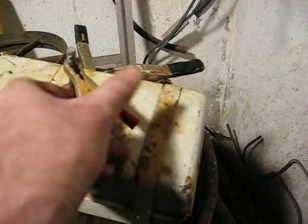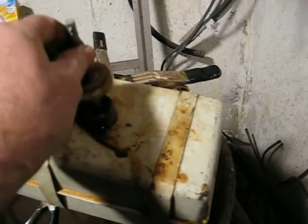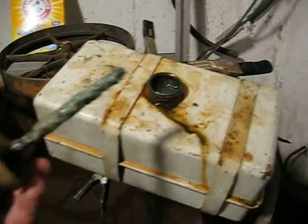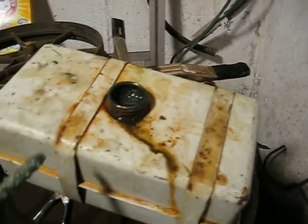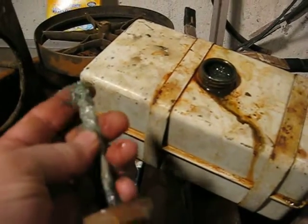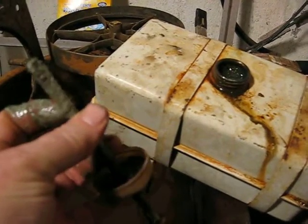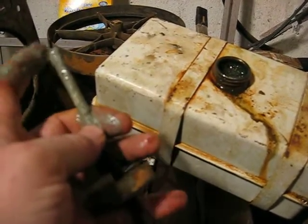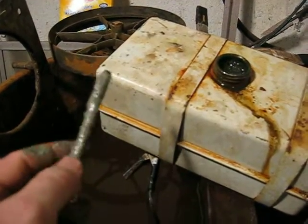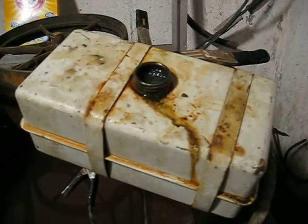Just to give you an idea of how well it cleans — as you can see, this is all being eaten up and the corrosion coming off the inside, and it's like a crystal that sticks on the anode there. It really gums up really quick, so you have to check it pretty much every half an hour to scrape it off and make it shiny and put it back in, or else your amperage will really go down.